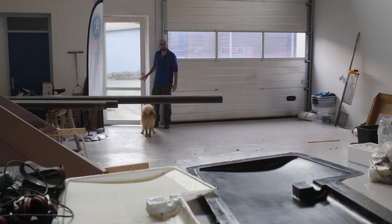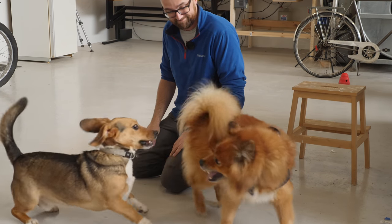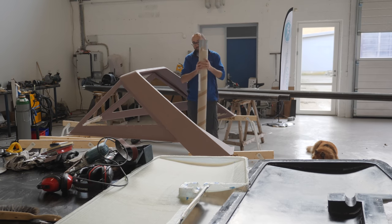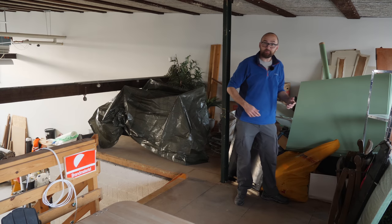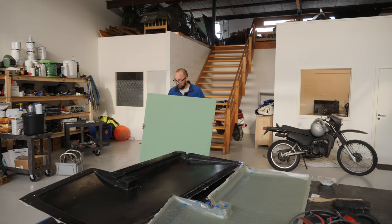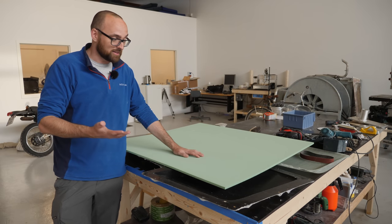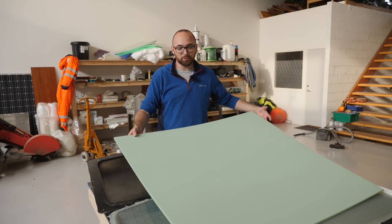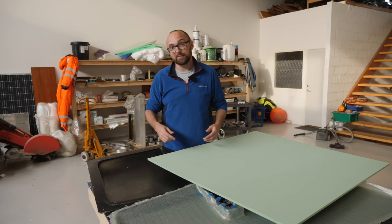Up in the workshop everything looks more or less like I left it. I picked up Jekyll yesterday and he seemed very happy to see me and to see his buddy Skipper again. While I was in the US, this exciting-looking packet showed up — these should be the new window frames for the dodger, but we'll get back to that a little later. I've also picked up the foam I need for the core in the new rudder. These are PVC foam sheets, roughly 10 millimeters thick, and they should be flexible enough to conform to the shape of the rudder. PVC foam is very commonly used for composite constructions in a marine environment.